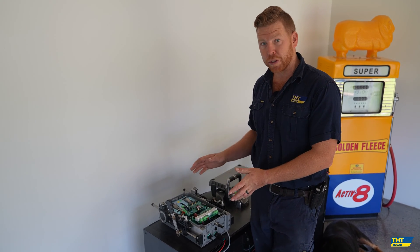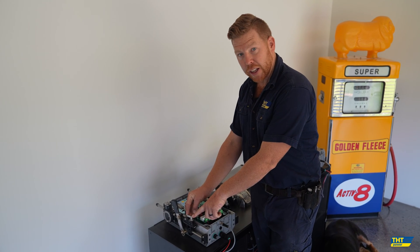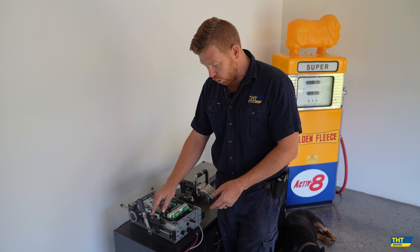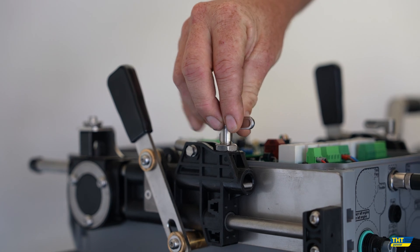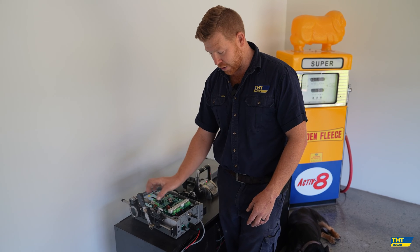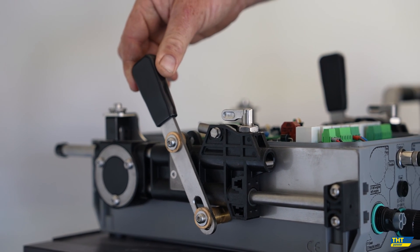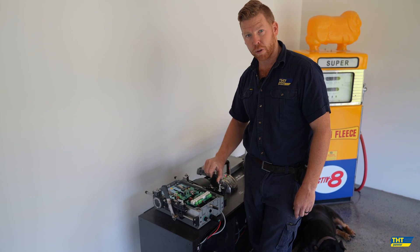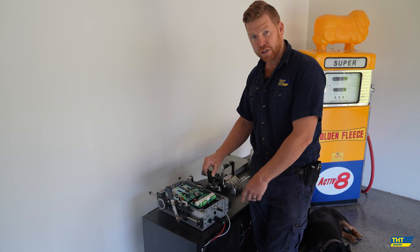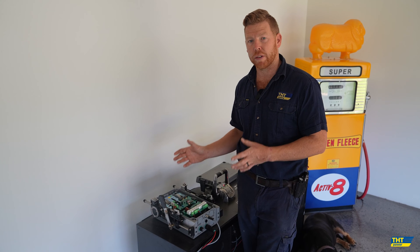Another great advantage of the Flexball system is that with the mechanical systems you've always got a mechanical override. This little lever here — if you had any power failure on board the vessel and there was no power entering into the actuator box, all you have to do is flick this lever 180 degrees and the lever then becomes loose to allow you to manually throttle up or down the engine. To reset it, flick the lever around and it locks back into position. Same with the gears — 180 degree flick gives you neutral and reverse positions. To reset it back into lock for electronic control, flick the lever around and give it a shake until it drops back in. Very simple but an amazing safety feature to ensure that you can always get home.